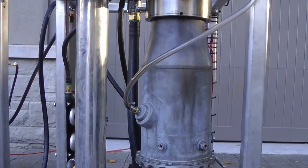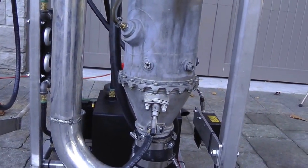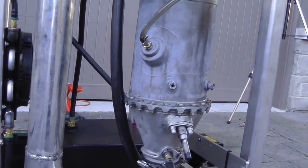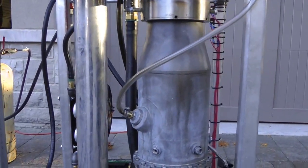The real beauty about this turbojet is that it uses the combustor off a Rolls-Royce Dart turboprop jet engine. On one of those engines, there are about eight of these combustors, all arranged in a circular pattern.